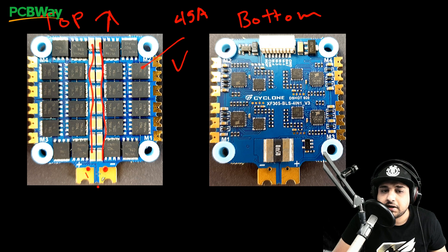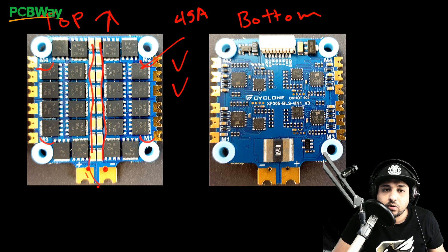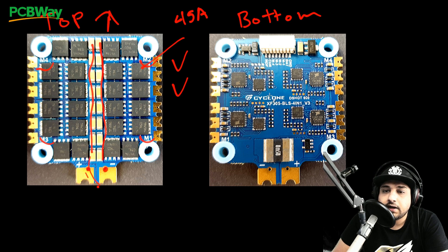Filtration doesn't fully check my box, but the design and ease of use do. The rubber grommets come pre-installed which is nice. Take note of the motor numbering — motor one, two, three, and four — with the front of the quad at the top and the battery leads at the back, and the FETs facing up. On the bottom side, the logic is very cleanly laid out and you can easily distinguish the four individual ESC circuits on the board. Each ESC circuit has six FETs — two FETs per phase, which is standard.